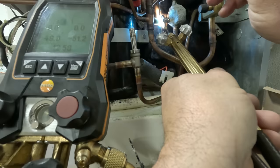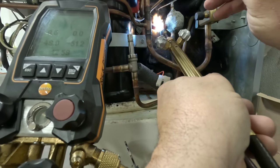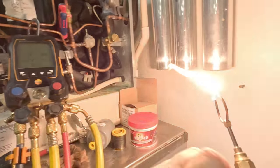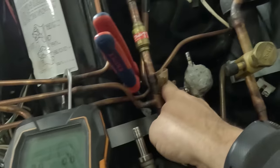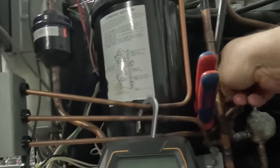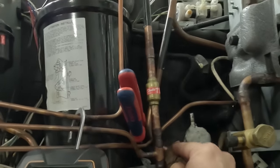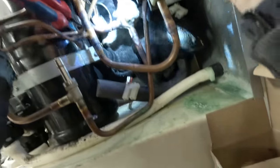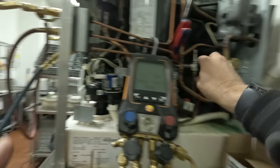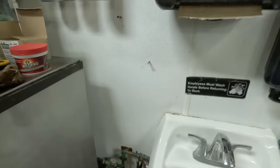Way more heat than I wanted but we got it. I'm not putting the torch directly on the joint — I'm putting it towards the back side where it's still solid metal so I'm not putting cooling effect directly to it. Some would disagree with that, but if I melt that mylar inside there even though I've got all the heat sink compound on there, I don't want to chance it. We're going to go ahead and take off our putty, re-wet it, and throw it back in the pail.